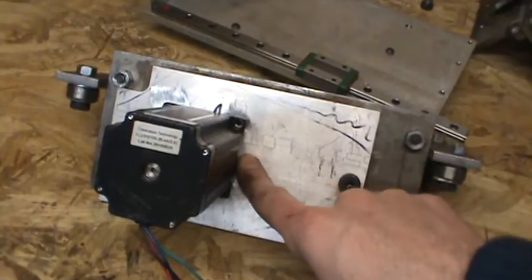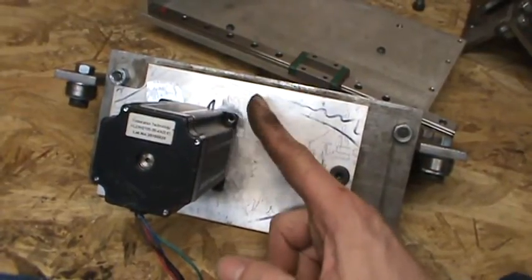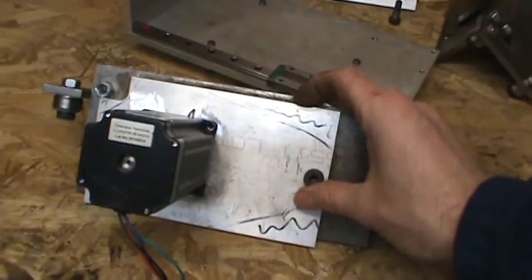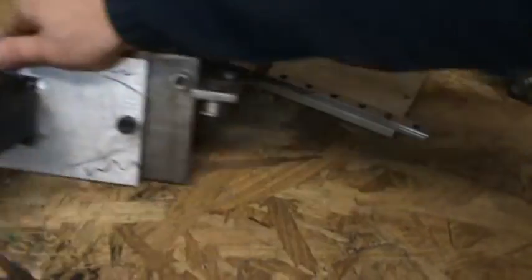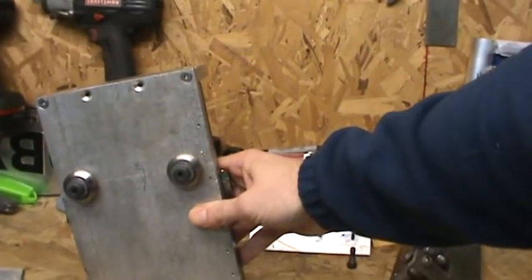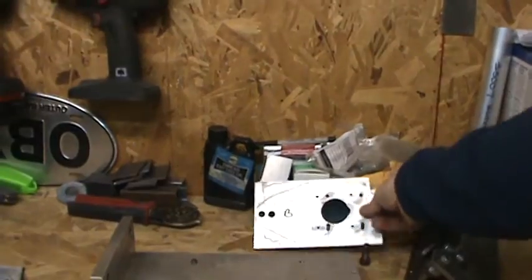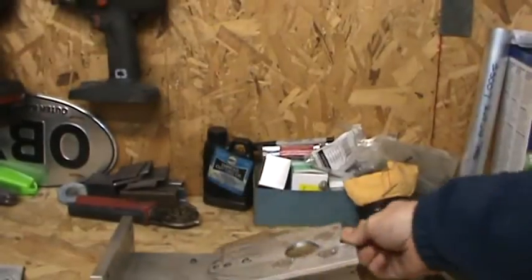Since I am doing direct drive, I'm going to use microstepping to try to get the resolution I want without spending money on a gear reduction for right now. I also have to order more quarter-inch by 4-inch aluminum plate because I need it to build the rest of the parts for this axis. I need to make a swiveling motor mount and a base plate for it — those are some of the things I'm working on.